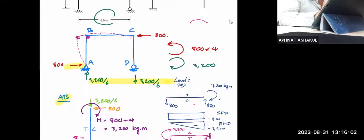And again, because joint C is rigid, if this angle rotates like that, this must maintain the rigidity. Therefore, since member CD doesn't have any moment, it must remain straight. See, no calculation required. Just understanding what you have from your mechanics of materials, and we haven't done anything new with it.